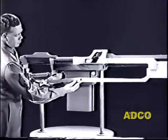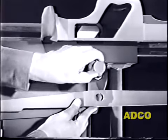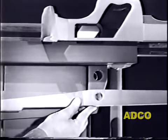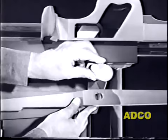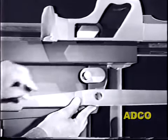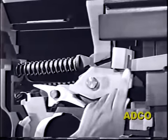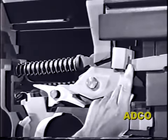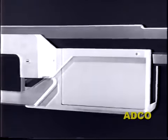Now let's consider the new pin only as a pivot point for the lever. The rear end of the lever fits into this slot on the trip, and both are under tension of the spring. The front end, or toe of the lever, bears against the cam which has been added to the slide.